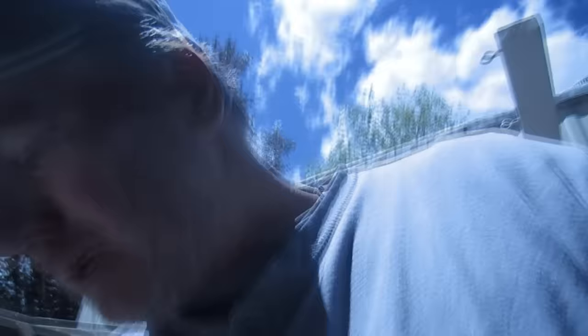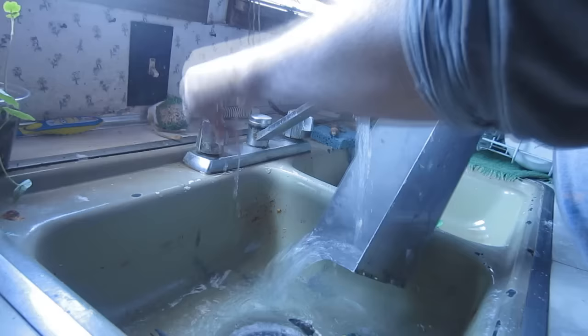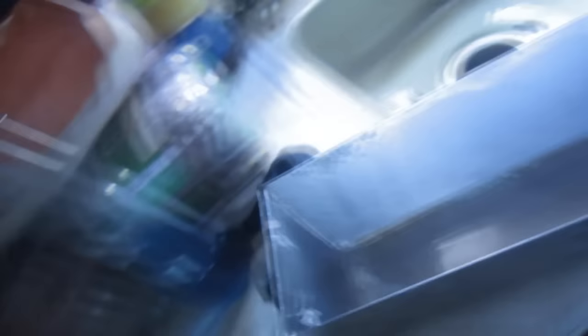I don't have much mud left, but I want to tell you guys — you shouldn't send this stuff down your sink because it can clog your pipes. It's hot mud, basically like plaster, which is just a wimpy version of concrete. If you send it down your pipes, especially with hot water after it, it cures very quickly and can clog the pipe. So just scoop it out of your pan, throw it in the trash can, and then take your almost-clean pan to the sink to wash off the rest.